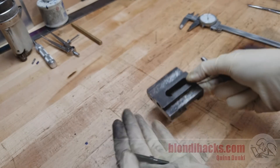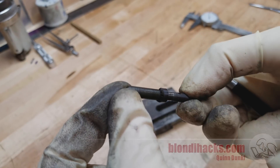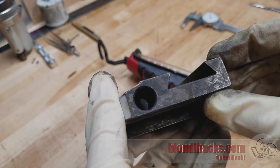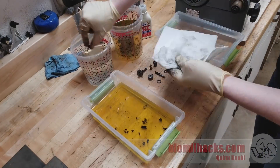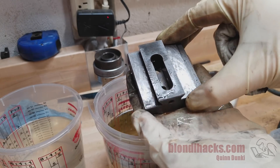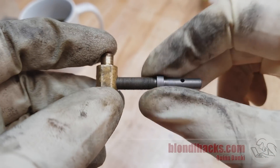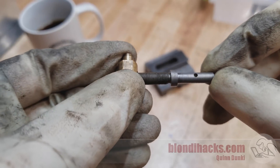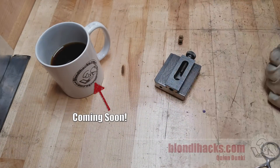This is one of those parts I really love in this machine. The thread on there is 0.5 millimeter — really, really tiny. You feel that when trying to unthread the feed nut; it takes forever. But the dovetails look like they're in really good shape, and after evapo-rust, clean, dry, and oiling, they came out great. You can still see the original scraping on there, so no work needed. The little lead screw cleaned up nicely too. I was debating whether to remake the brass nut, but it's in really good shape with no backlash, so I'm leaving it as is. Now we just reassemble — the reverse of removal.